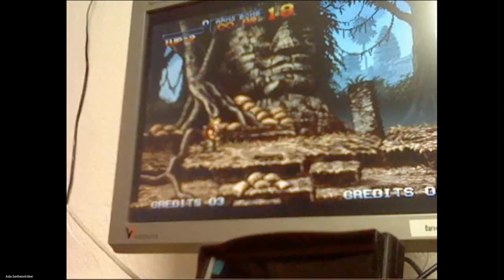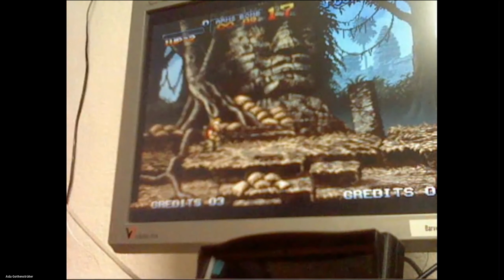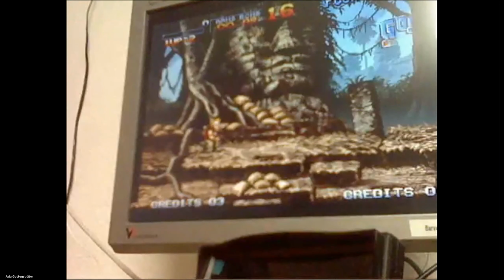Would you agree, Ada? Yeah, I think with the VGA output, this is actually using some sort of fractional frequency. In fact, I think I eyeballed the pixel clock to something that would give me the right frame rate on the monitor OSD. I think that's actually what I did. Don't tell anyone. Yeah, because video is so revealing. You have to respect it. You have to give it kind of preeminence as far as clock rate.